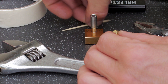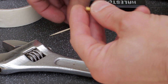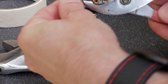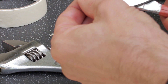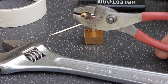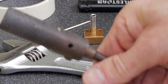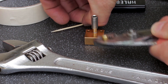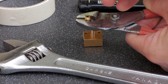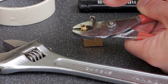Right here we've got the nozzle and the heat block. Essentially what I did was I got a handful of toothpicks — or cocktail sticks — and these are dirt cheap, so the great thing is you can use them each end and then bin them afterwards. I clamped the nozzle in a pair of pliers like so, so that I could hold it without burning myself, and then I heated it up using a blowtorch. A little turbo flame lighter would do the same job because you're only heating a small area. You heat it, stick your toothpick in, rotate it around, let it cool a little bit, then pull it out — and you'll notice it pulls out lumps of filament onto the toothpick. Then turn it around, do the same, discard that, get a fresh cocktail stick, and just keep doing this.